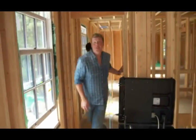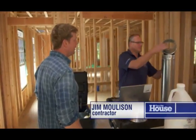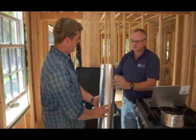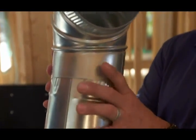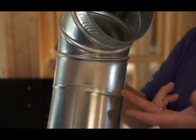Jim Mollison is our HVAC contractor on this job. Good to see you, Kevin. Why are these systems so leaky? Why is this such a big problem? Well, the typical system goes together metal on metal. This ductwork snap locks together — you can see through the seam — and when we put the ductwork together, you get a seam here that's metal on metal and the air leaks through.